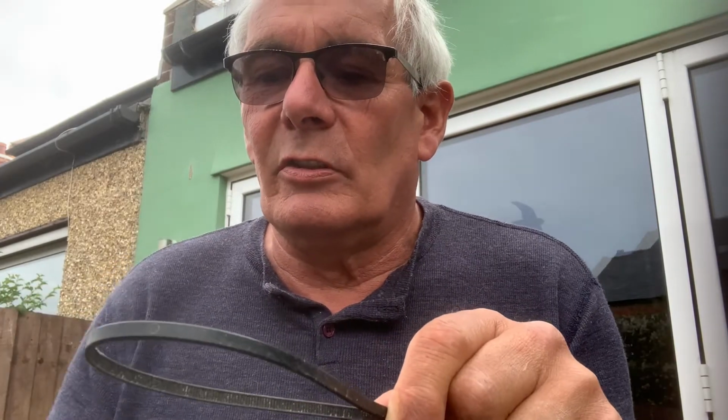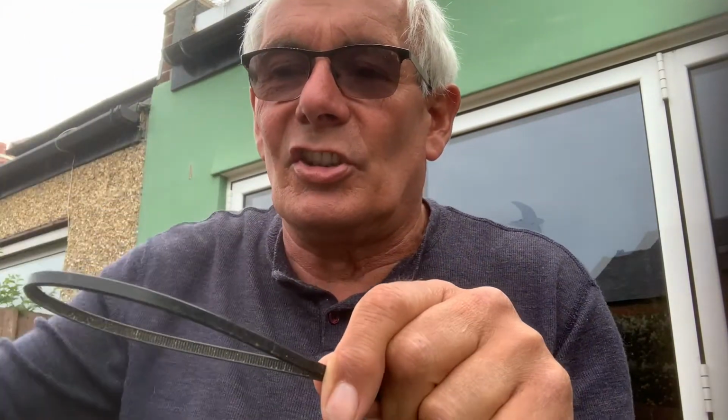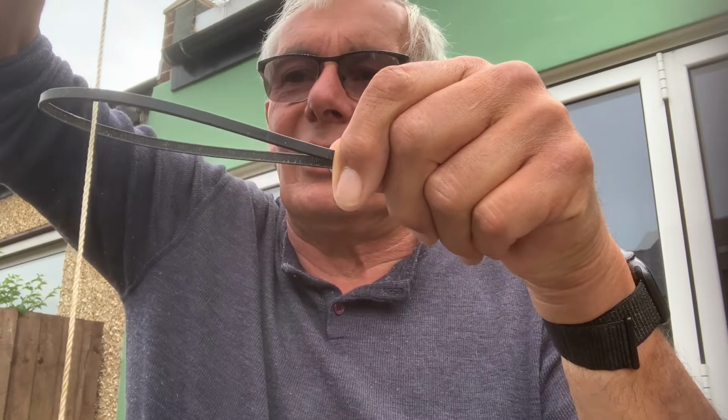We dropped that down the mast, dead simple. Andy's idea was to use a cable tie, which is excellent, and literally you just put that in the slot you want the halyard to come out of, and drop this down the mast. As you can see, when you push it through, it's thin. Once you drop it through, it opens out, and so we're able to just drop that down the mast and straight into it, and then just pull it out. Dead simple, very effective, very quick.